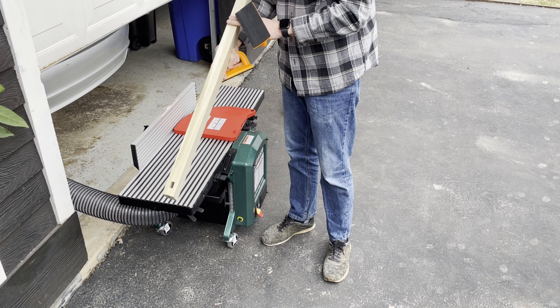On the first pass there's sapwood on top that's not hitting just because it's higher than the rest of the board. I made three or four passes on this just to try it out and it was a lot more successful. I think I'm making just under 1/32nd passes on these, and you adjust it on the end of the table. It's ending up a lot better — very smooth, not really getting any snipe lines. The lubrication really helped as you push it so you're not struggling. It came out really square. So I had already face-jointed it.